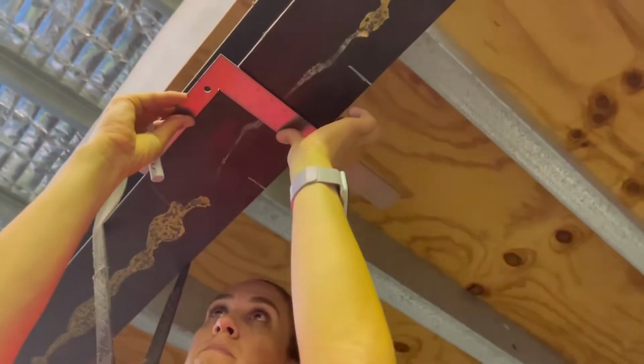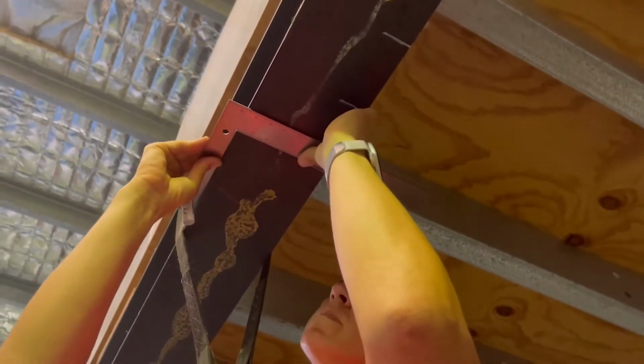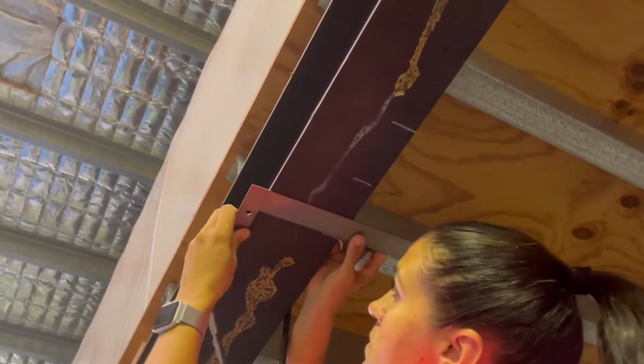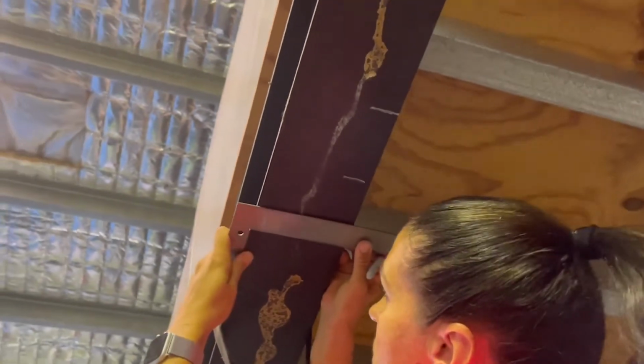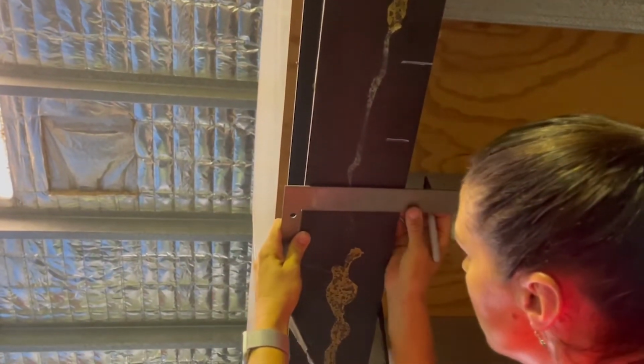We're now going to use a set square to make as accurate measurements on the beam, and it's much safer or better to look from underneath the beam to avoid parallax error so that you can get the squareness of the beam clamp ensured.